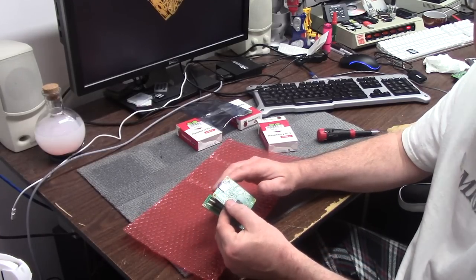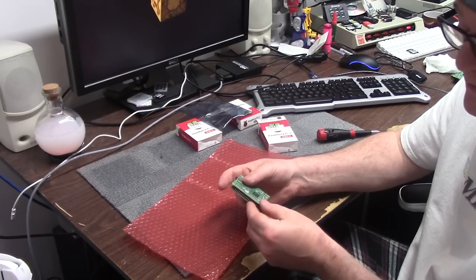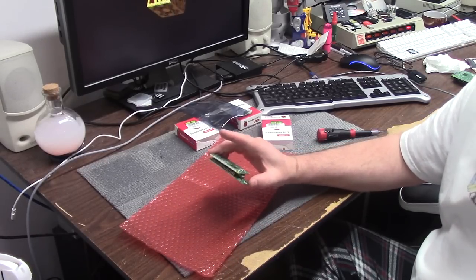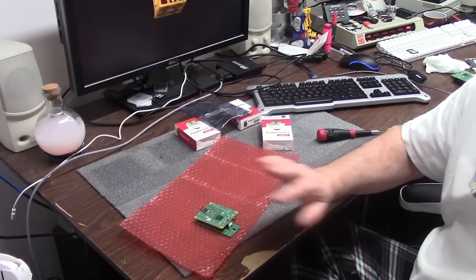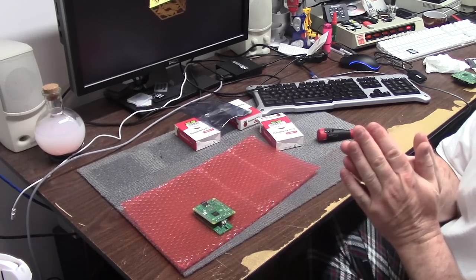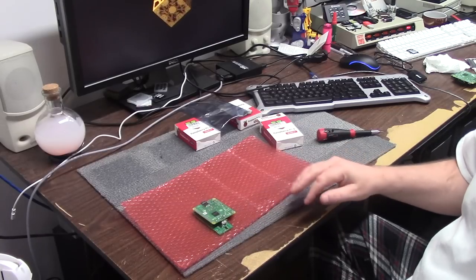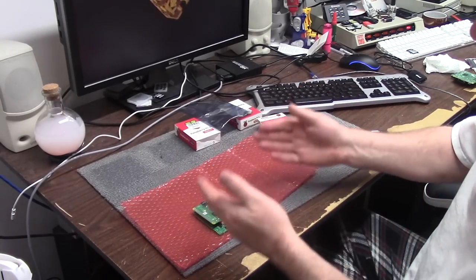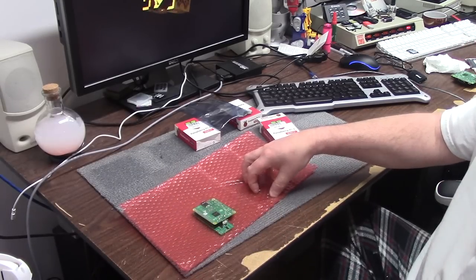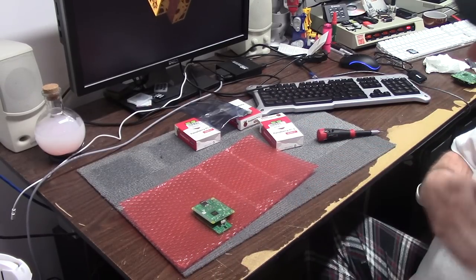This can work both ways. This does not take over your system like a vampire, the standalone. This still lets your Amiga be an Amiga. This is a super duper CPU in base form, and that's what we're going to do today. We're going to do the vanilla build. We're not going to get into virtual hard drives. We're not going to get into the advanced features of changing CPU types. Well, I'll put it to an 030 probably, because by stock the default config is an 020. And no FPU or MMU. If you change the CPU type, of course, you get those advanced features. Without further ado, let's get started.